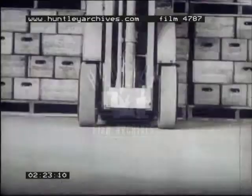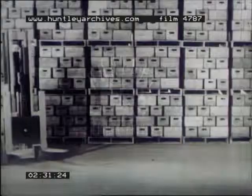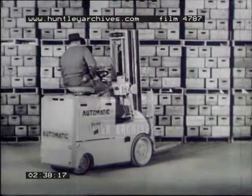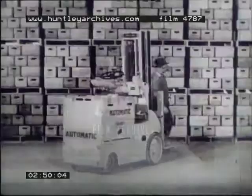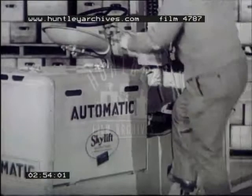The large rubber area on the wide drive wheels gives them long life. Inverting them adds four inches in width for even greater stability. In this first electric fork truck with automotive type controls, the operator can dismount from either side — a real time saving and safety factor. The driver's seat is padded, adjustable, and shaped for the operator's all-day comfort. When the driver remounts, a special handrail and footwell provide added safety and convenience.